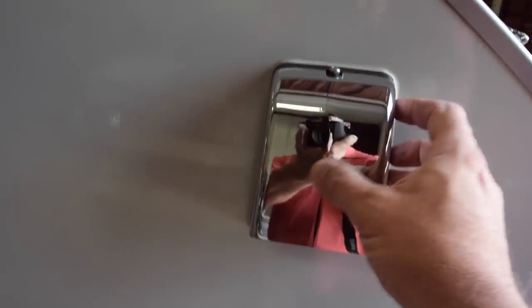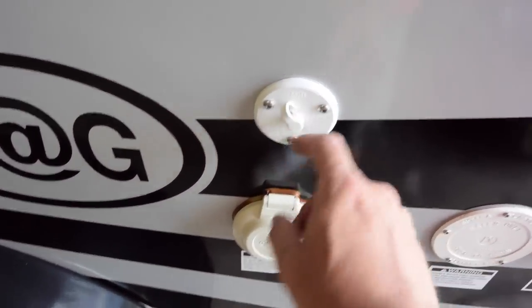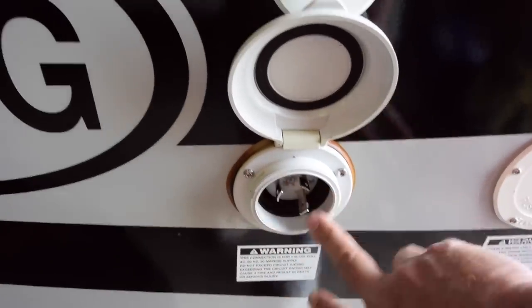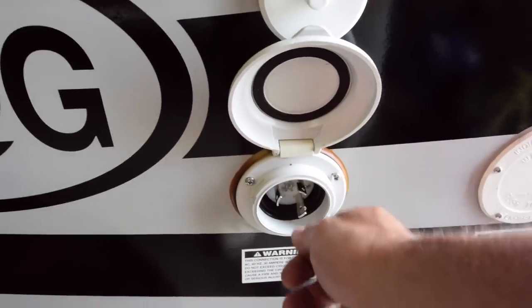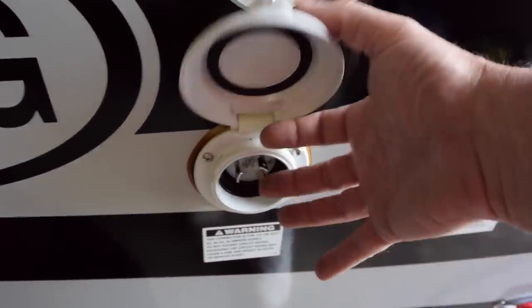Next, air features. There's a vent on each side. The air conditioning system inside is basically a window unit — a Frigidaire unit — and there's a blower to make it work more efficiently. It blows the exhaust out of the back of the air conditioner through these side vents. You've also got pre-wired cable TV, or you can hook a regular TV antenna. It has a 30-amp power cord; the old models had just a regular 15-amp extension cord.